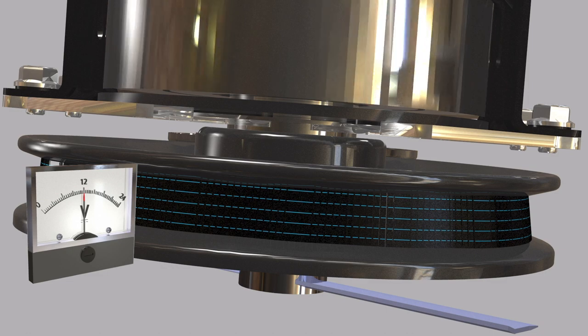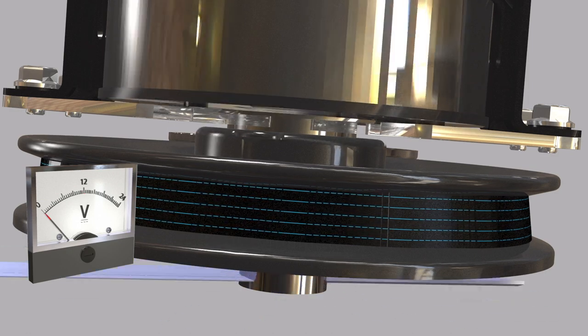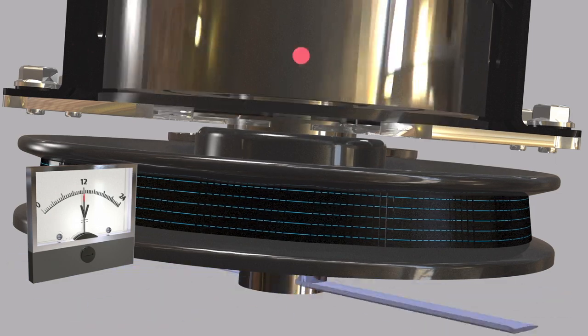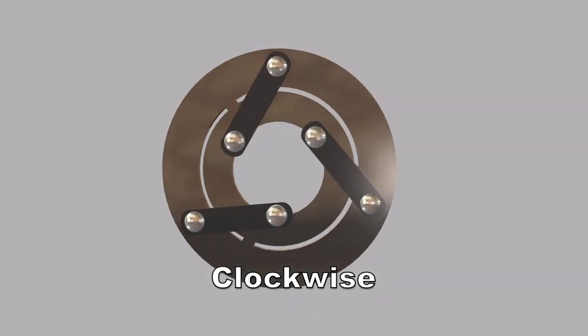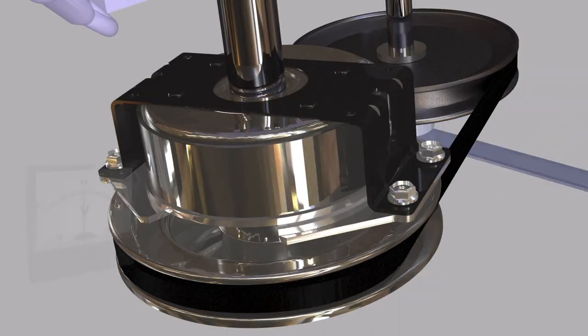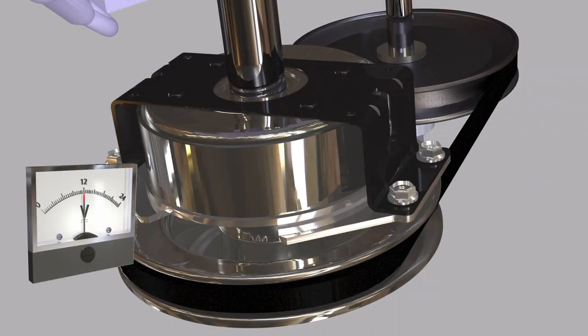The torque is transmitted from the armature through the leaf springs into the pulley. The springs need to run in tension, not compression, so clutches are either built to run clockwise or counterclockwise. When the clutch is fully engaged, torque transfer is 100% and there is no relative slip.